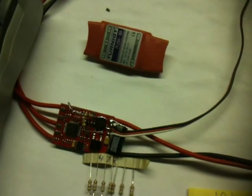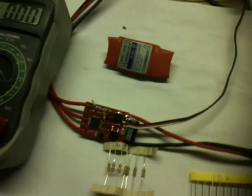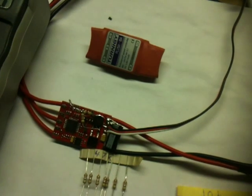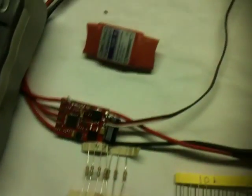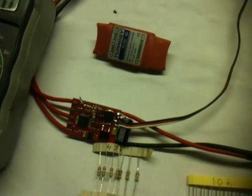It is possible to remove the voltage cutoff, but then you have to be careful when you fly. Run with a LiPo alarm or something so you know when the battery is running low so you don't damage it. But it's better that the battery runs low than you crash and lose everything, I think.